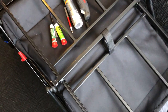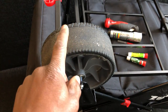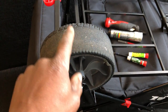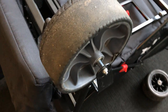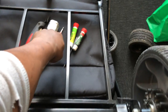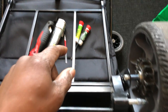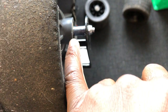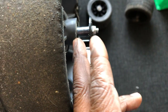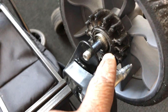Let me start by saying we are using the original wheels from the first wagon, because these are the pure rubber wheels. These work so much better in most terrain. Now let's talk about why I used the pin casings as spacers — as you can see, I use them as spacers to prevent the bearings from coming out of the wheel frame.